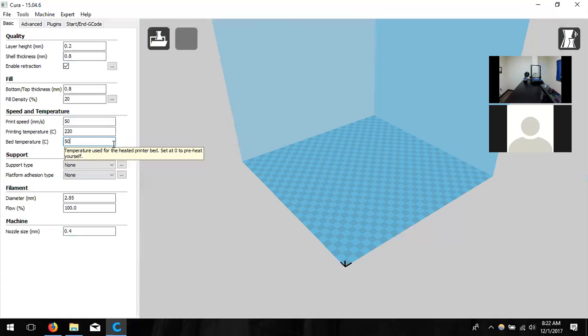Will that limit us to certain filament types? The only filament I've found I can't use on these printers is ABS. That's not really a downside — PLA has increased in all its strengths since desktop printing started. You can still achieve things like HIPS (high impact polystyrene) and PETG, which is much more structured. Carbon fiber composites should lay down fine. The bed temperature might not be hot enough to prevent warping for ABS, but most other prints will sit successfully on it.